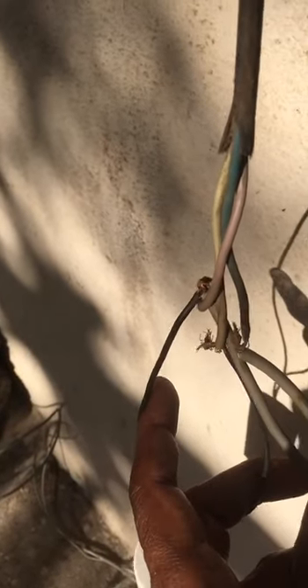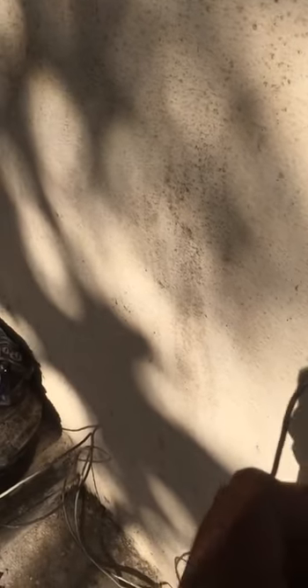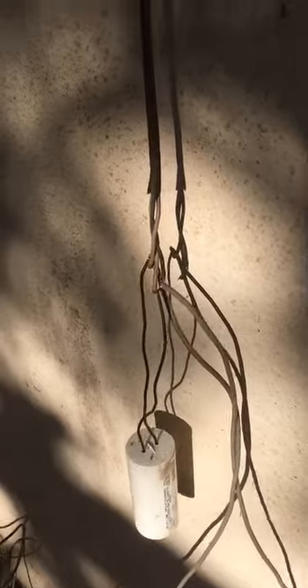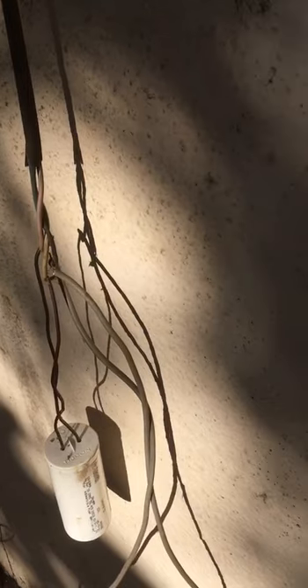What I want to show is there are three wires coming from the submersible, and the house AC line has two leads, single phase. It is connected to two leads, and then the extra third lead is connected through the capacitor. This is unique for me — I have heard of it but never seen it. Today the technician will come once again and change this box.